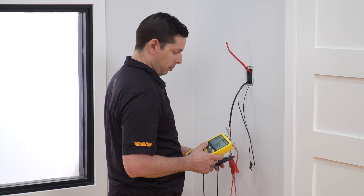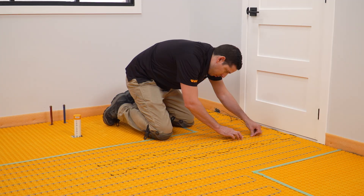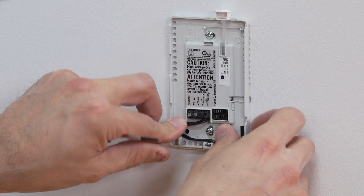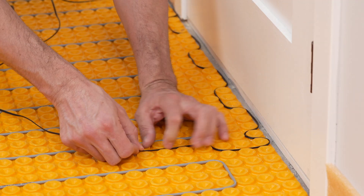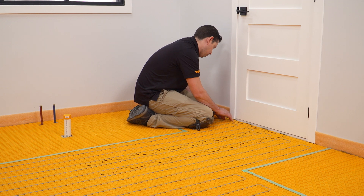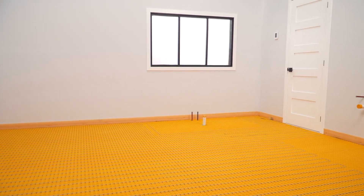Repeat the three heating cable tests to verify the cable was not damaged during installation. The floor temperature sensor is installed within the tile bond coat. Two sensors are supplied in the heating cable box. Both sensors are installed, while only one is connected to the thermostat. If the first sensor is damaged, then the second sensor can be easily connected to the thermostat without removing tiles. Install the temperature sensors so the tip of each sensor is located in the middle of a three-stud cable run. The sensors must be at least 12 inches from the wall. Run the sensor to the desired location and secure the tip in between studs. Do not overlap or cross the heating cable. Fasten a metal protection plate at the base of the wall to help prevent damage to the cables if a baseboard will be installed. The installation of the heating cable and floor temperature sensors is now complete.